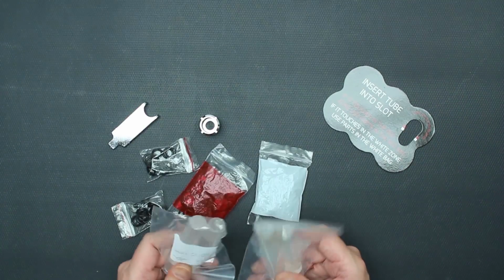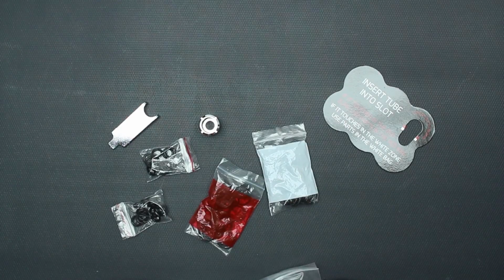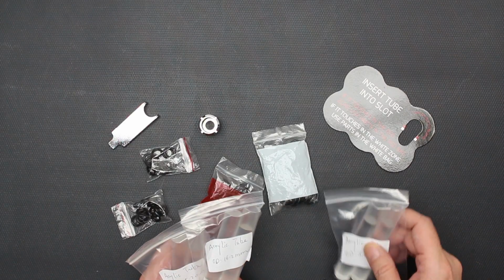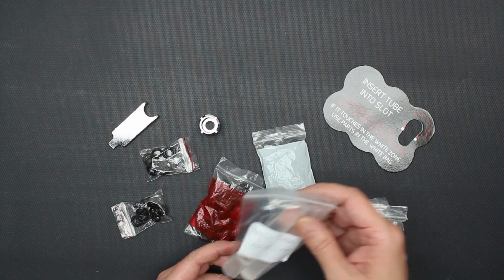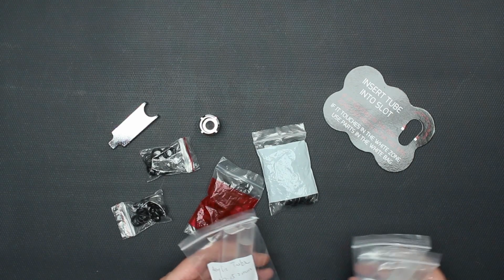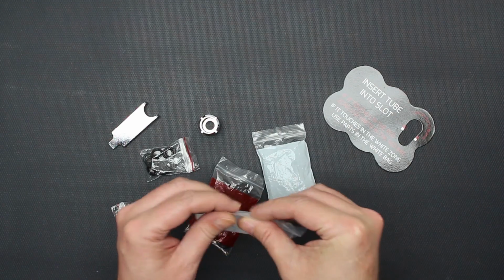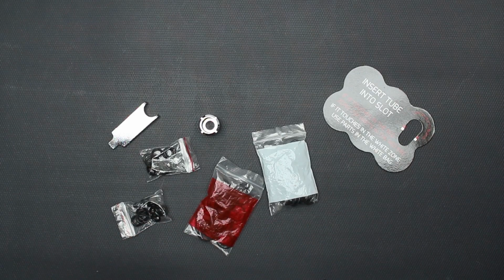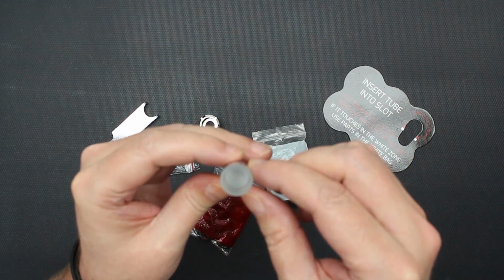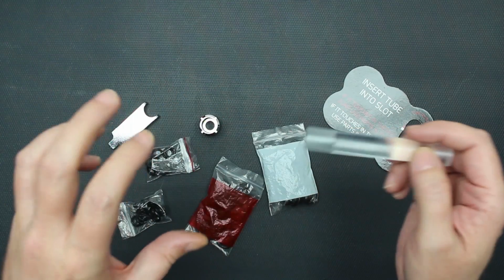And what these engineering samples let us do is develop different size seals and ferrules for different size tube requirements. Okay, I tracked it down. So we've got 15.6 millimeters to 15.8, 16.2 to 16.4, 15.2 to 15.4. That covers the whole range. I'm going to open up here and show you real quick. These are engineered, machined, and then polished to a very specific size. One end of them is hollow and simulates the tube, and the other end is solid so that we can chuck it into a jig that we use to measure pull-out resistance.